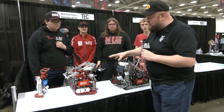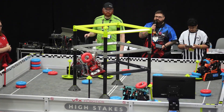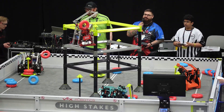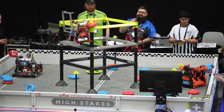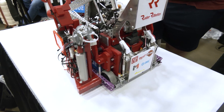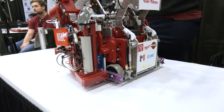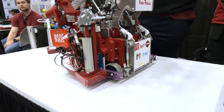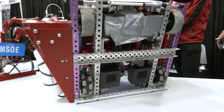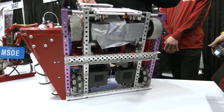Let's take a look at this robot doing the tier three climb. Let's talk about this climb first — how does it all come together to get a climb in auto? So it starts out, we have a 10-motor box of motors here, which gives us 110 watts for climbing. That's a lot of power — enough to carry itself and the other robot. And then we have a PTO underneath here that shifts so that we can climb and pull from the same box of 10 motors.